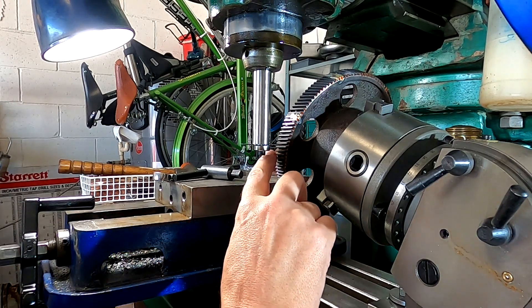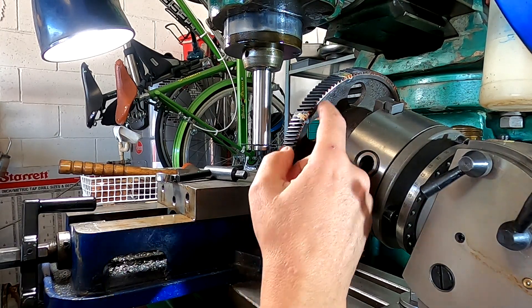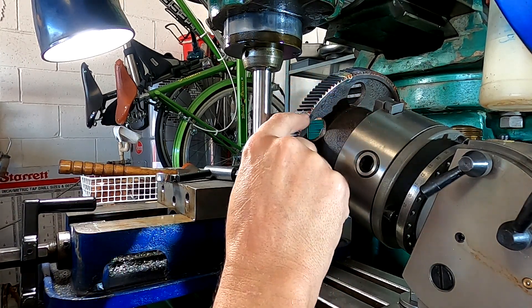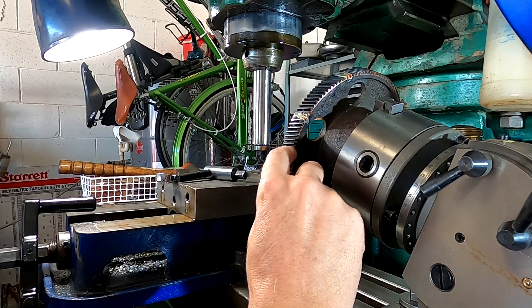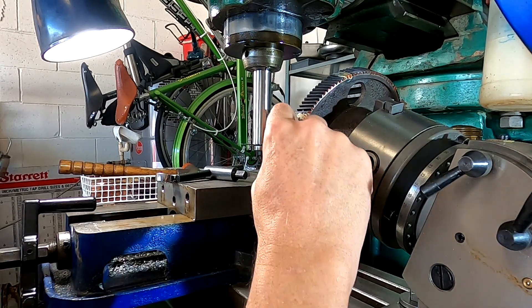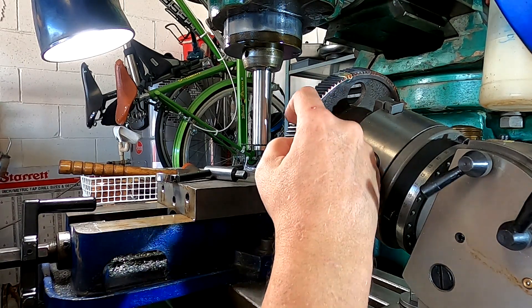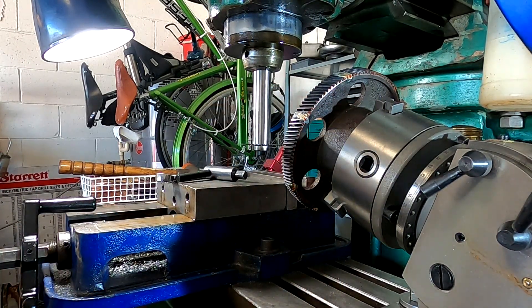I just spent the last 20 minutes setting this up to cut this gear tooth out. The blade, when brought around and centered, will cut right down between the two teeth as we come through each area that's been brazed in. It's not as wide — it doesn't act like a hob and doesn't cut all the way back to the tooth form — but it's going to take about 90% of the material out of the way. Then we'll follow behind with a small file, using the rest of the solid tooth as a guide to file it into place. It sounds low budget, but it works since I don't have the proper tool for this.